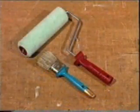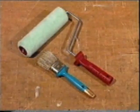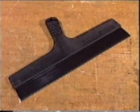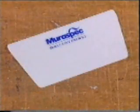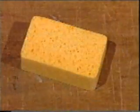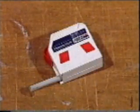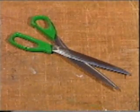The toolkit required will include a large synthetic pile roller, sleeve and brush for the application of the adhesive, a 45 centimeter steel spatula, which has a variety of uses, a hard plastic spatula for smoothing out the wall coverings, a sponge for cleaning down any adhesive residues, a measuring tape, a pair of good quality decorating shears for cutting drops, etc.,